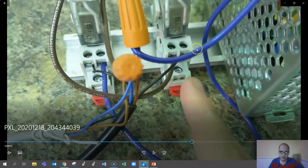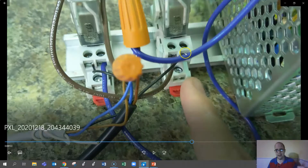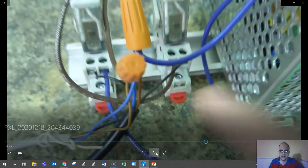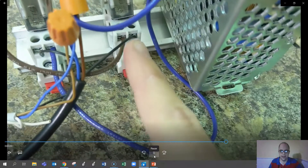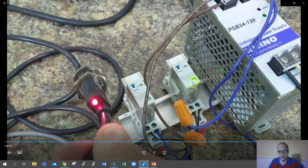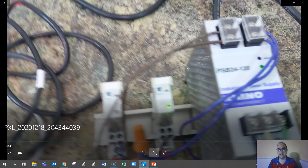I also have a photo eye wired NPN. The black wire lines up on the other end. In this case, read the documentation — here the blue is positive and brown is negative. Just look at the signal wire: I have a positive going into one side and the signal wire on the back end. You can see the difference: this one is PNP, this one is NPN. They're identical relays but two different sensors based on how they're configured.